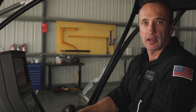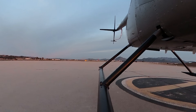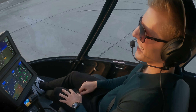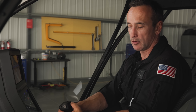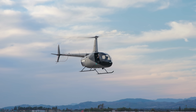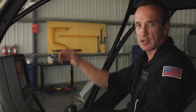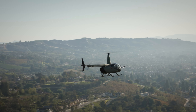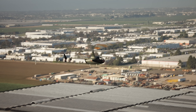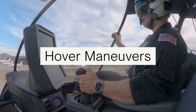We have two methods of picking the helicopter up. We have 'swipe to pick up' — literally a swipe of your finger — and SkyOS will bring you up to a stabilized six-foot hover without you doing anything. You also have the option of a manual pickup, where all you have to do is actuate the VTL, and the aircraft will automatically trim itself to a neutral stick position. Once you're in a hover, the aircraft does it all itself. Whether you're in a squirrelly hover, going into clouds, a brownout, or a whiteout, the inherent stability will right the aircraft instantaneously when the pilot simply lets go of the stick at any phase of flight. The aircraft will maintain heading and give you time to decide what to do next.